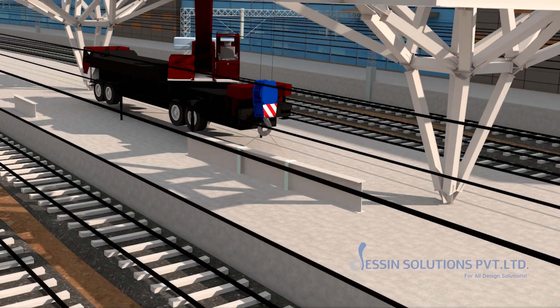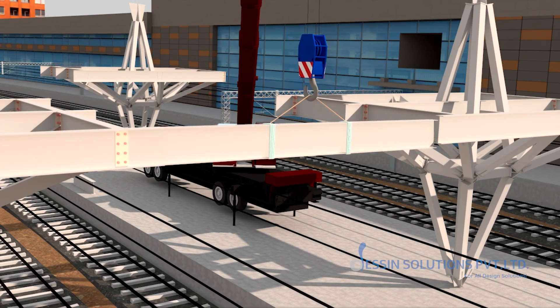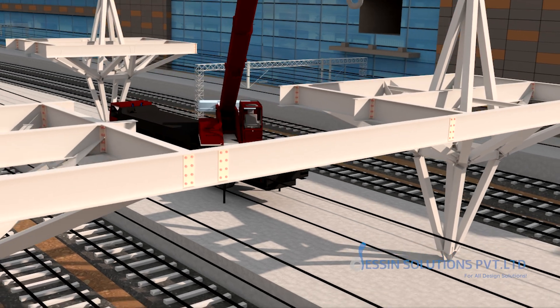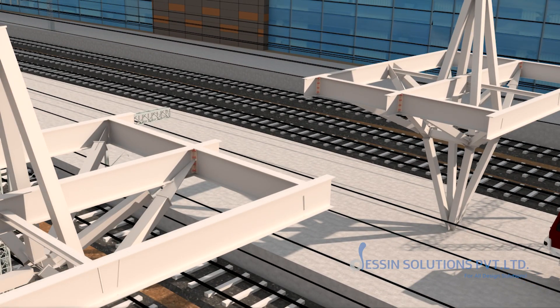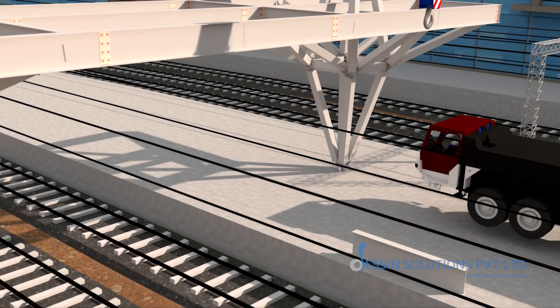With B3 columns in position, left side girders over tracks 5 and 6 will be hoisted, each girder spliced and bolted to both columns for unyielding strength. The same chronology will unfold on the right side in the next traffic and power block.